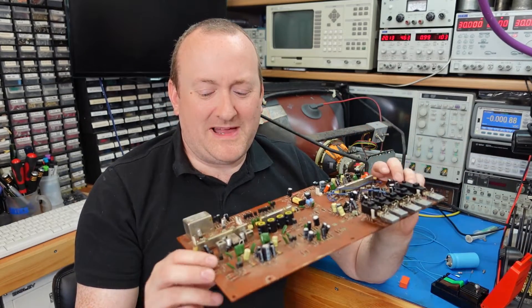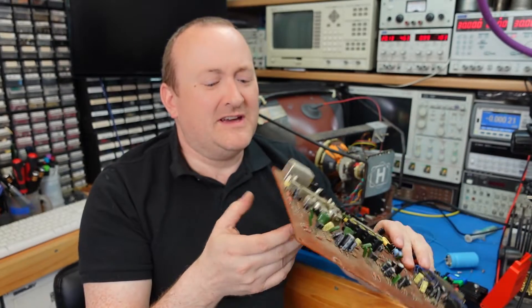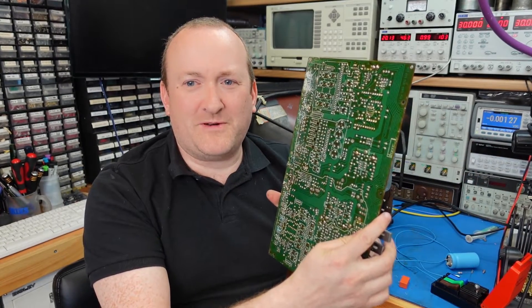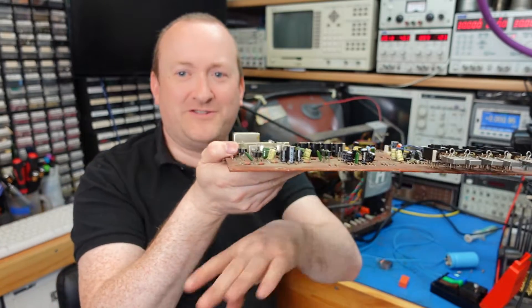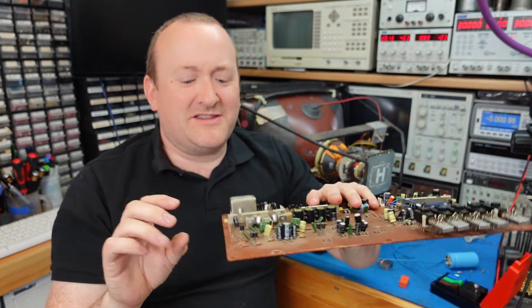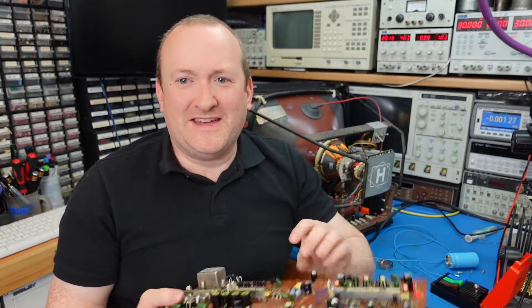The temperature of the drying oven is critical. On old vintage circuit boards, the plastic parts just weren't up to high temperatures — these were soldered with wave soldering where the solder just went over from underneath, so the plastic parts never really got that hot. They will melt at quite a low temperature. I've ruined quite a few things by melting them, believe me.